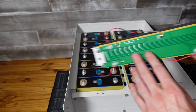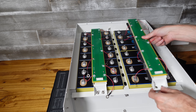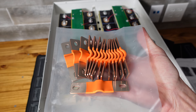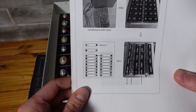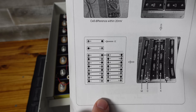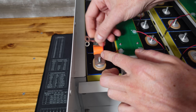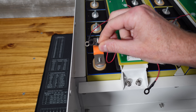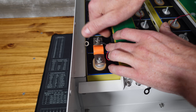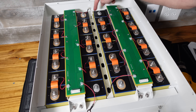Making sure to select the correct top plate — this is the one that goes B8 through B15 on the most positive side. I'm making sure not to get any balance leads pinched underneath. Next, I'm ready to get the bus bars connected. I'll be referring back to the diagram in the manual — each line drawn between posts is where a bus bar goes. Very carefully, I'm placing the bus bar on the cells and double-checking the connections as I go so I don't accidentally short out a cell. I take the appropriate balance lead and place it over one of the battery posts, and each one gets a serrated flange nut, running them down by hand first. The last one to drop in is the longer bus bar, which joins the two packs together in the rear.